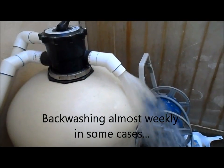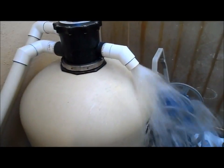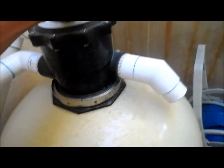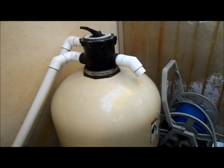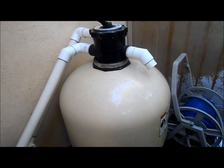You're doing a lot of backwashing with this filter to get it to operate properly - it's really a waste of water and time. You don't want to backwash it for more than a minute and a half because then you'll start getting the sand out of the filter. This is way down on my list of filters to put in your backyard - it's really inefficient, and I would stay away from the sand filters.